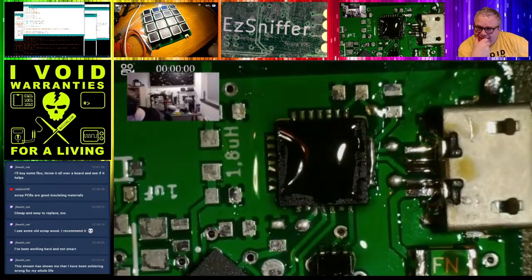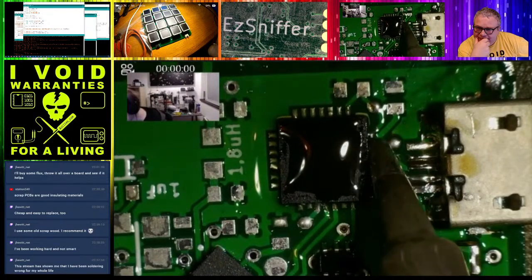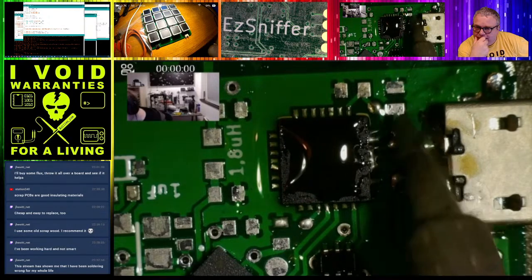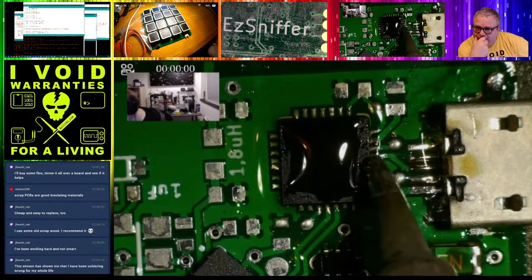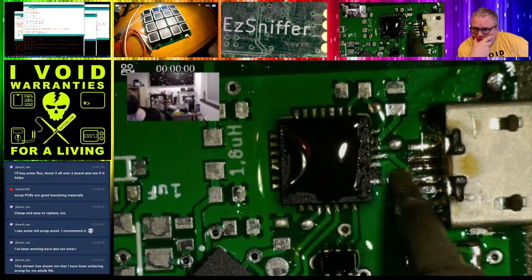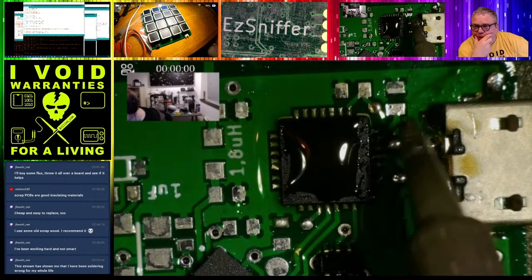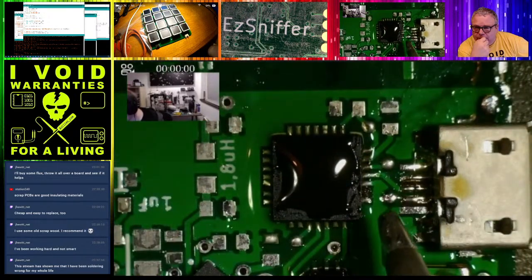That's a little bit too rich. Let's clean the tip. Let's do it again. Almost. It's getting there. Yeah, this I run into: it's the thick traces. That's sucking away the heat, but it's almost clean. Oh, that's a destroyed pad. Did you see that? Yeah, that's fine. It's not connected.